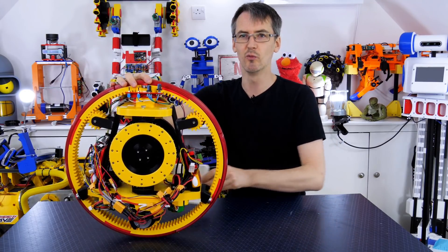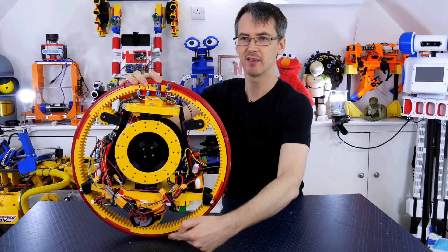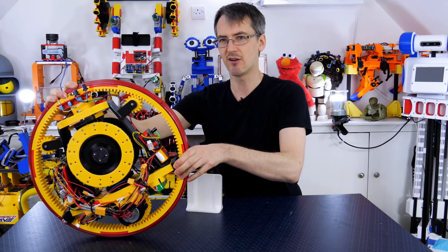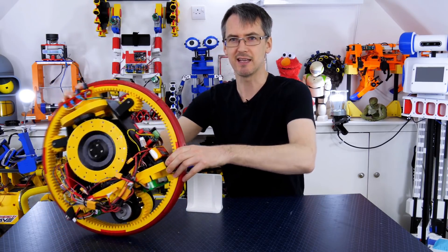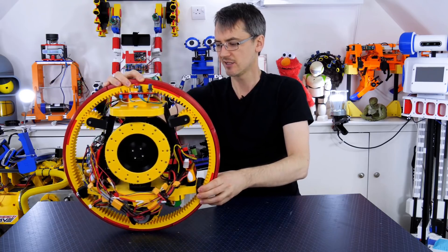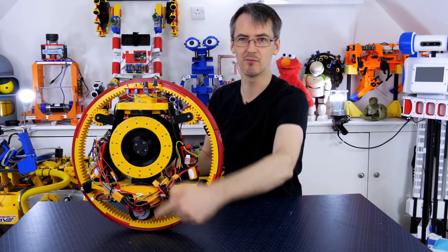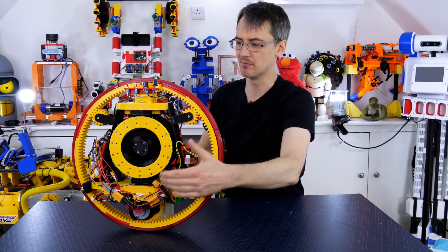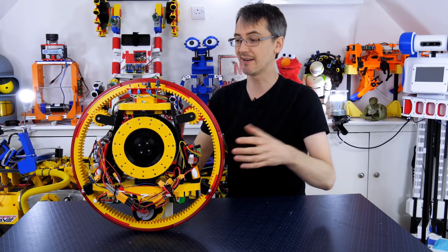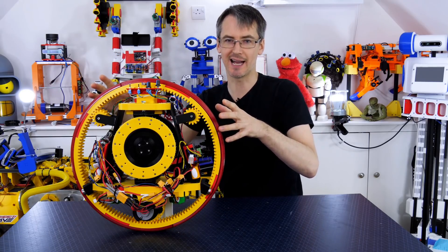What I think is happening is: normally we use these gyros to stabilize side to side and they're completely upright, but as we drive along and tilt the chassis they start to exert a force in an unexpected direction — as I lean this way it causes it to steer the other way. The moral of the story is not to use gyroscopic stabilisation unless the gyroscopes are perfectly upright or pretty much upright most of the time. This one deliberately leans over to drive, and that causes it to twist in another axis as those gyroscopes have gyroscopic precession in that slightly off-center axis.